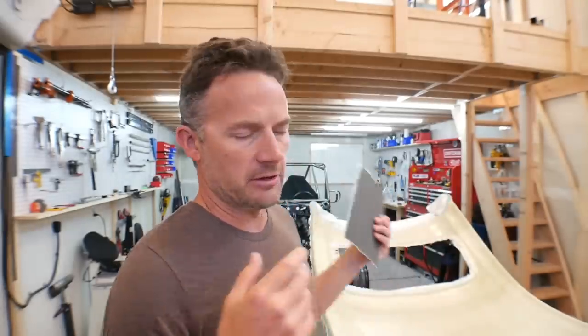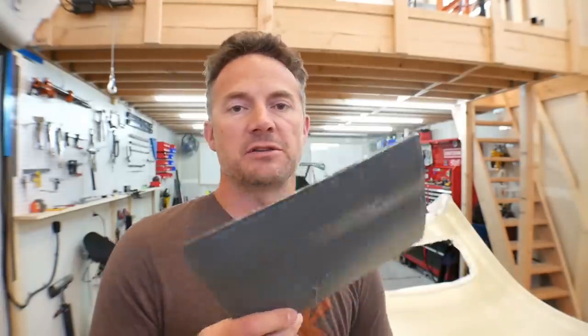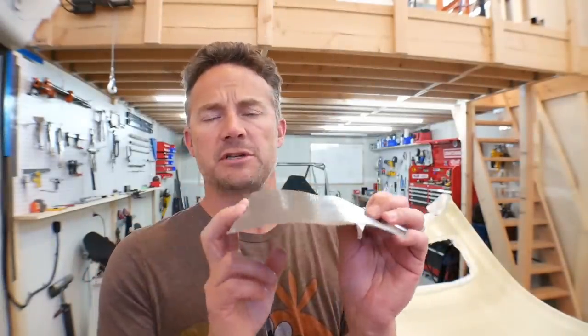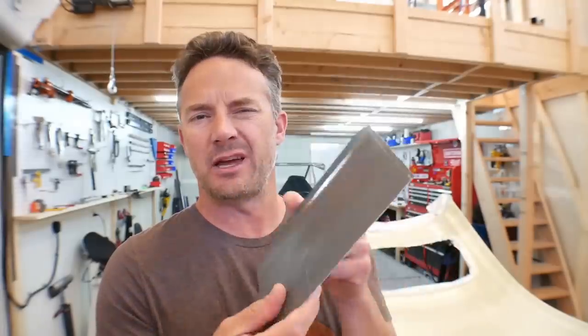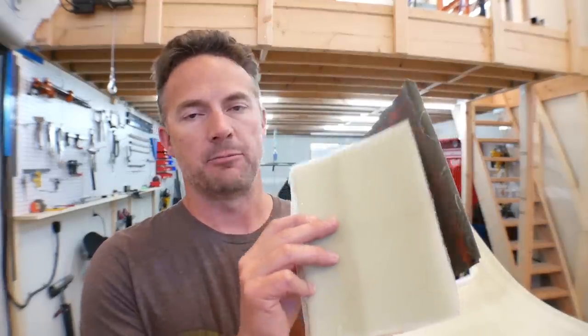As I've been doing this, both for the mold and the actual roof piece itself, before I spend all the time and money on the actual fiberglass piece, I've been making practice pieces. This is the first piece I made when I was experimenting with making the actual mold itself. It's just like the mold — the mold is three to five layers, this piece is two layers, but I built it the same way. After I had the mold made, I took this piece and smoothed it out, waxed it.